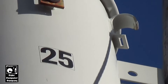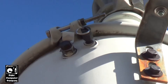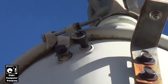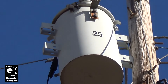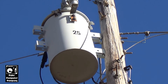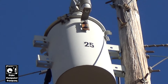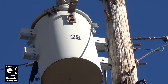There is the other lifting ear. Up here, I believe, is our pressure relief valve. If this unit gets over pressure for any reason, it allows that pressure to escape. It can also be manually pulled to equalize the pressure — for example, if the utility takes the transformer out of service to service it, before they open it they have to pull that to release any pressure or vacuum that's built up inside, to equalize the internal and external pressures.